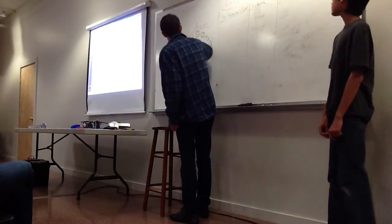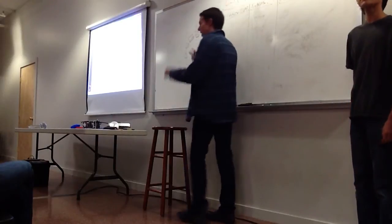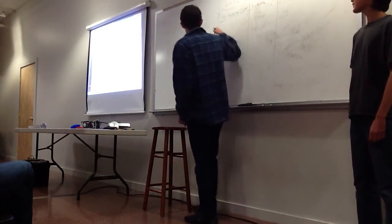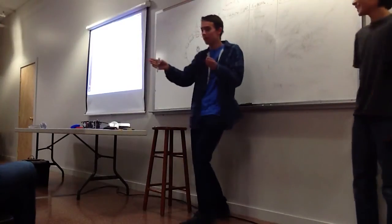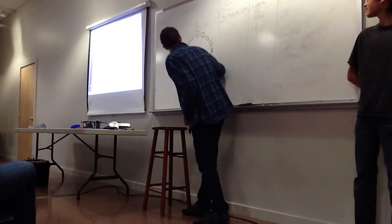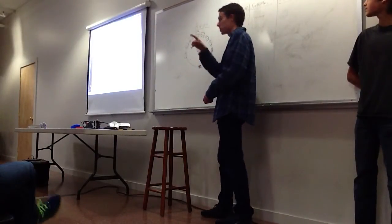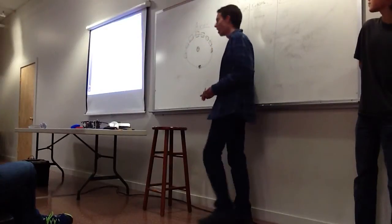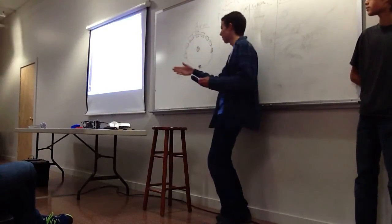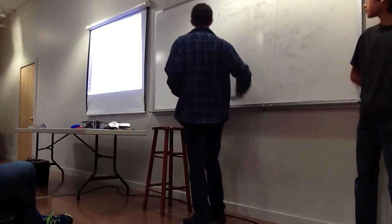Omni wheels have these wheels that are basically a wheel inside a wheel. It's like Inception. So when you pivot, let's say this is the bottom of the robot, we have one of those wheels inside a wheel right there, and they're all around the circumference that I'm trying to show here. That wheel will turn when you're trying to pivot so that your robot doesn't skid.